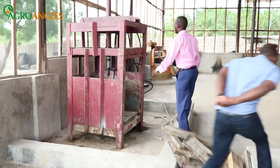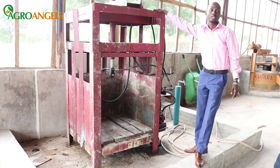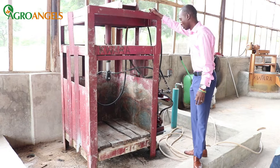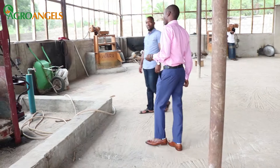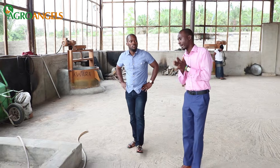From this place, we bring it down to the pressing section. This is perhaps the most powerful machine here — it has a ring, as you can see, and can take up to 22 packs of cassava at a time, pressing them in about 30 minutes. You put in your cassava and press it. What you want to achieve in the press is to de-water the cassava — every bit of water has to come out. That's what we do here in 30 minutes, and it forms the crushed cassava into a cake.